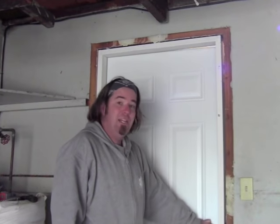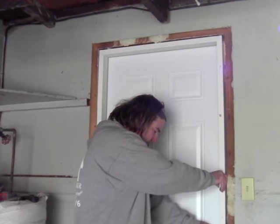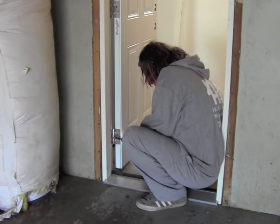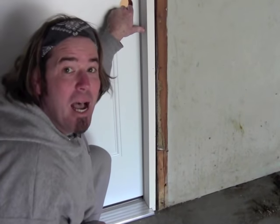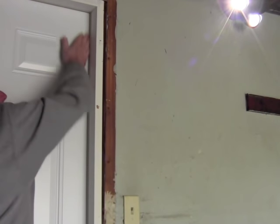When you shut the door and it's shutting smoothly without dragging, you can place the other side by where the door contacts the weather stripping. Level is secondary — you want to make sure the door shuts, seals, and is secure. Now I'm going to secure the bottom hinge and do the same thing as I did with the top hinge: make sure the inside of my door jamb is flush with that inside wall. Let's make sure our door is still shutting nice. You can see when I shut the door the strike side contacts the weather stripping — it's doing awesome. But I can look up at the top and see that it's sitting out about a good quarter inch; that's not going to seal well. I can get a whole finger in between it, so that's going to need to be pushed in just a little bit.